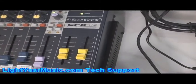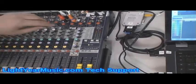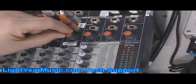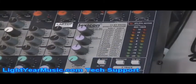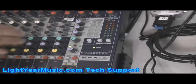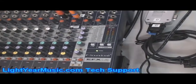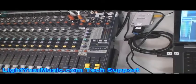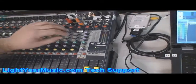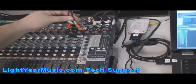You're always going to have to make sure the master volumes are turned up to a level, and then you can control everything else individually through the buttons in that particular line. On the laptop row, there's a red button that says 'gain' — that gives us individual volume for that row. Going down, these buttons are more designed for microphones where we can get into high frequencies, mid frequencies, and low frequencies. You don't really have to concern yourself with those too much for the laptop — you can leave them at 12 o'clock. So that's going to take care of our laptop.